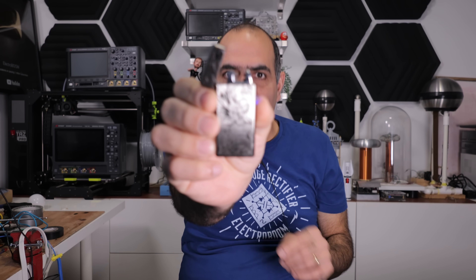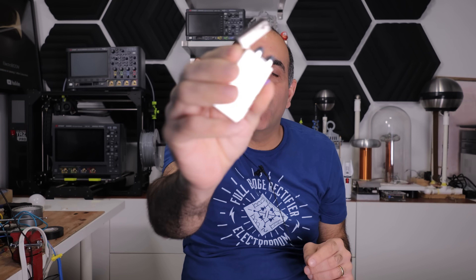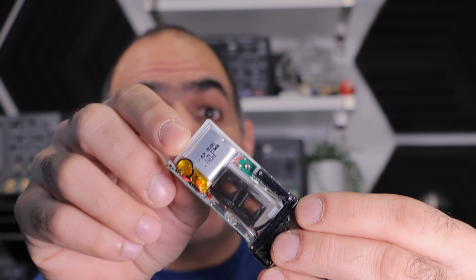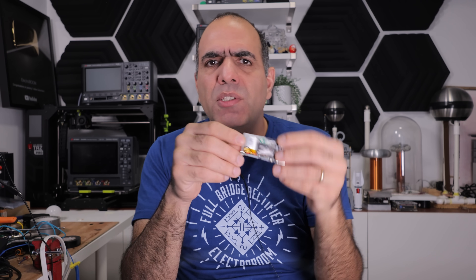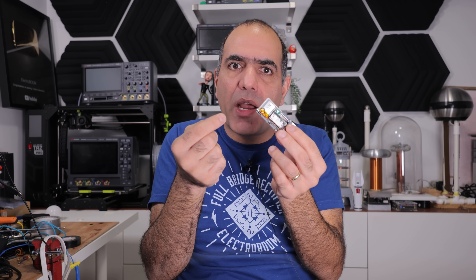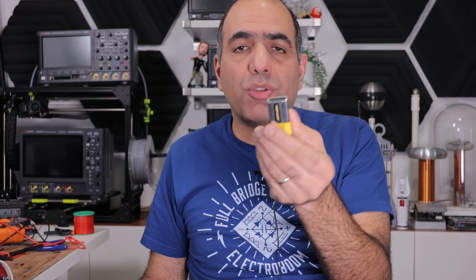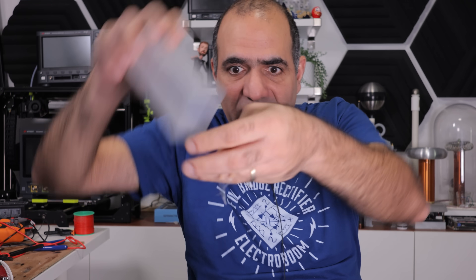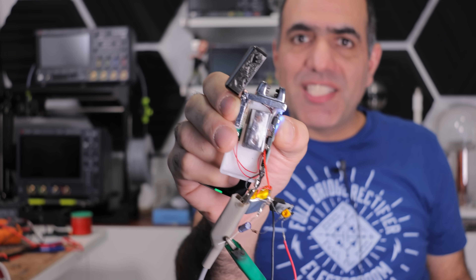It's so simple you can do it at home without all that equipment. All you need is one of these arc lighters. If we open it, it's running on a single-cell lithium battery at 3.7 volts average. To change the arc output power, I need to change the supply voltage by making the audio signal ride on this DC supply voltage. All we need is to add a 9-volt battery and some resistors and capacitors to the circuit. And here's what we get — I hooked up my radio to my lighter. Let's listen to it.